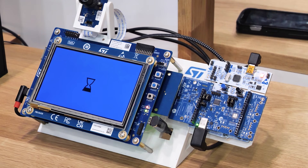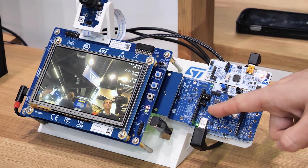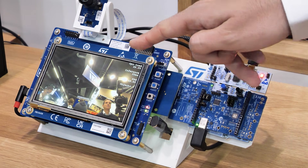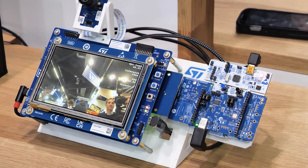After, the firmware package is transferred over-the-air from the PC host using the USB2 protocol. Once the package transfer is complete, the ST60 resets the microcontroller and activates the application here on the STM32N6 Discovery Kit.